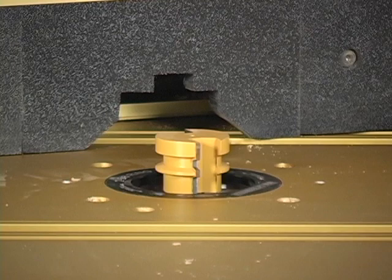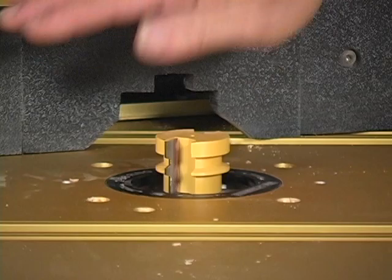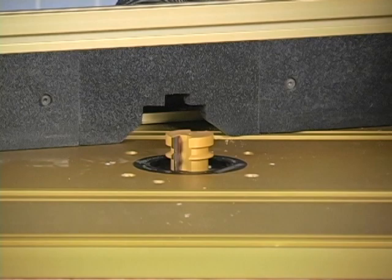Now, like all these bits, they don't have a bearing, so you have to line the farthest cutting edge of that bit up with the edge of your fence. If you set your fence too far, you're going to get sniped. If you don't set it far enough, you're going to leave a square edge on there and your board simply will not go together. So we're going to swing our fence over,